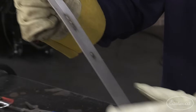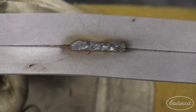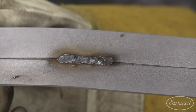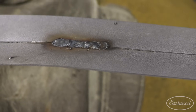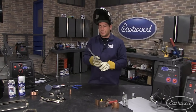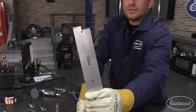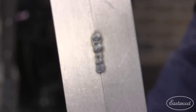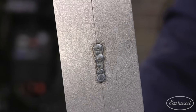You can see there's no gap in between - I was overlapping and stepping each of my welds. Those welds aren't sitting up real tall like the other piece we showed. They're pretty flat, not much grinding needed. You can go over it a couple passes and it'll smooth right out. On the backside, you're getting 100% penetration - these pieces are completely fused together. The weld is not just sitting on top; they're nicely fused together.